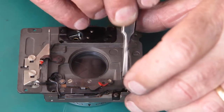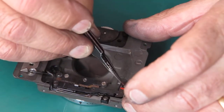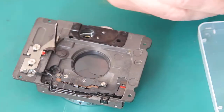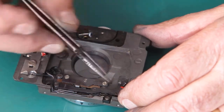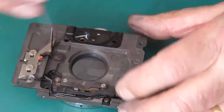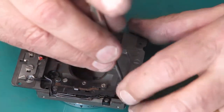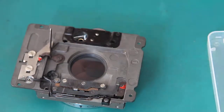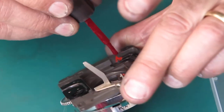The arm — I'll just put a wipe of molybdenum through the pivot where it's held with a shoulder screw, and on the back face, particularly the underside, that's where the rack has to lift it. That's good. It's a shoulder screw so it supports the bush in the middle of the gear, and the shoulder also supports this arm and allows that to move freely. I'll do that up tight. This bracket is essential because it stops that arm from flapping about in the breeze.